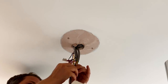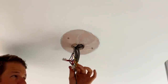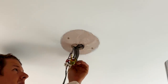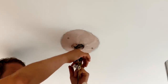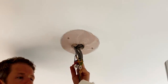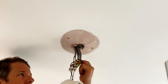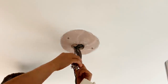This is a real classic DIY jobby — whoever did it basically just put everything in connector blocks and shoved it up into the ceiling. I need to sort all this out. What I'm going to do is put all this into a WAGO box and put it up in the ceiling, then just run one cable into the light, because the BT14 light fittings I've got — it's better to do a WAGO box up in the ceiling.